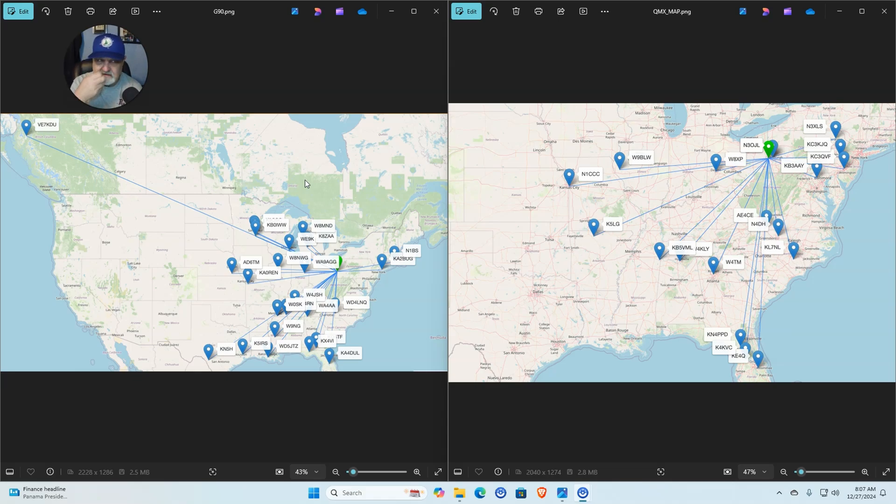Does it make a big difference if the radio tunes it or if it's a resonant antenna? As you can see from the G90 — and this is also different days, so this could be different band conditions — the G90 was all 20 meters. You can see one contact way up here in Canada, VE7KDU, above the state of Washington. That's a pretty good trip for that little 78-inch whip antenna with three 53-foot ground radials. Through the center you're looking at all the way over to Texas, looks like Nebraska — right around that mid-states, like the Mississippi line somewhere through there.